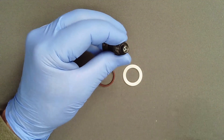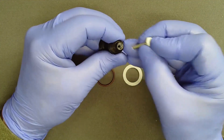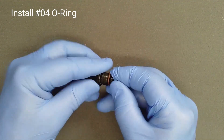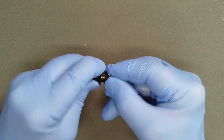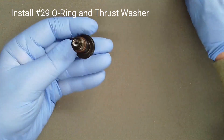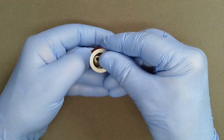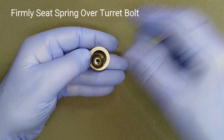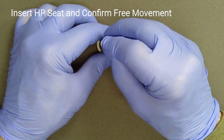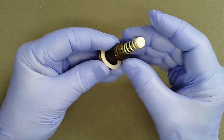Take the old high pressure seat and, using it as a tool, pass it part way into the O-ring, sliding it back and forth twice to make sure that it is centered. Add a lubricated O-ring to the land below the threads, then add another lubricated O-ring to the land at the base of the turret, followed by the thrust washer. Place the spring firmly over the top of the turret bolt. Insert the high pressure seat gently into the O-ring and depress it slightly to make sure that it engages properly.